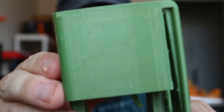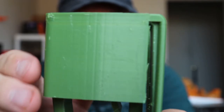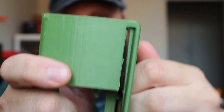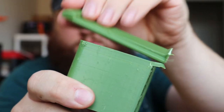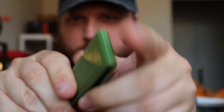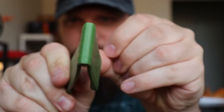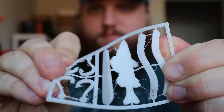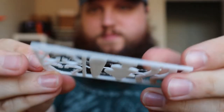The second consideration is how material layering will affect structural integrity. While layers get pretty good adhesion, 3D prints are definitely weaker when force is applied in a way that causes torsion against the print layers. This could cause the layers to delaminate and your 3D print to split perfectly along a layer line. Design your item so that force is applied in a perpendicular manner to the way the object is printed. With the survival snap card redesign, the forces applied to the hooks and lures are already perpendicular to the layering.